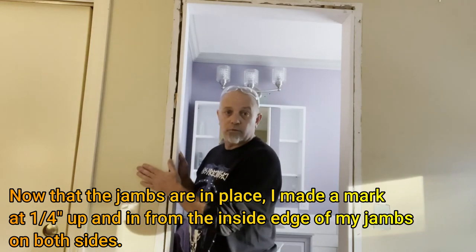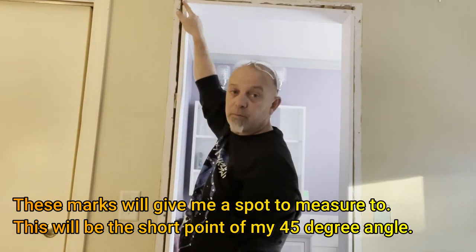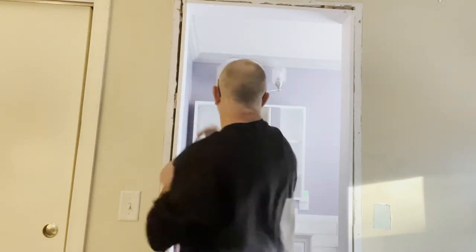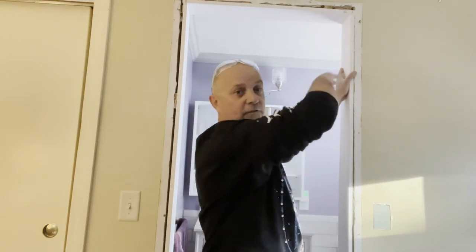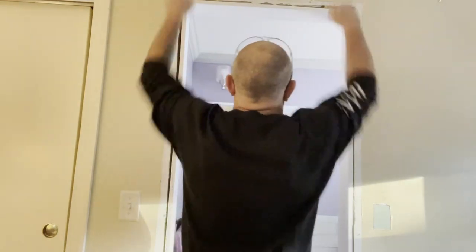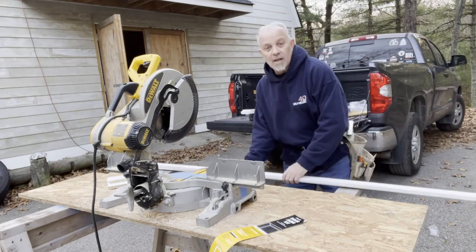The trim is going to sit flat on the wall. It's going to get a 45-degree angle cut right here and line up on that corner. I'm going to measure from the floor to my cross — that's quarter inch in this way and quarter inch up — so from the floor to the cross, that'll be my short point, and I'll cut a 45-degree angle up like that. On this side, do the same thing from the floor up to my quarter-inch mark — that'll be my short point and I'll cut it on the flat angle up this way. So 45-degree angles go opposites, and then my top piece will get 45-degree cuts this way and it'll sit right inside. I have the same measurement on both sides.